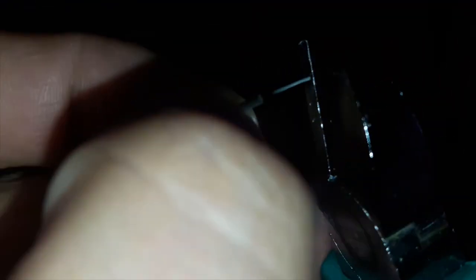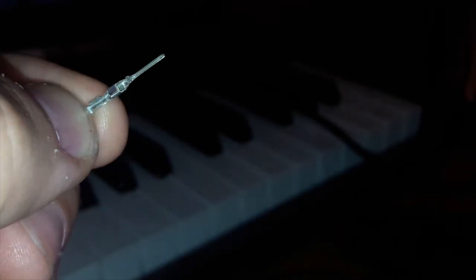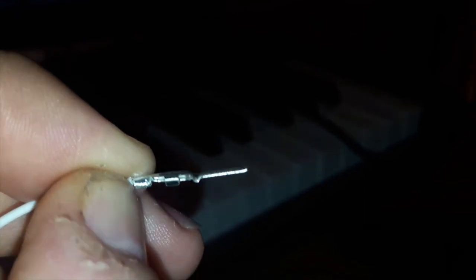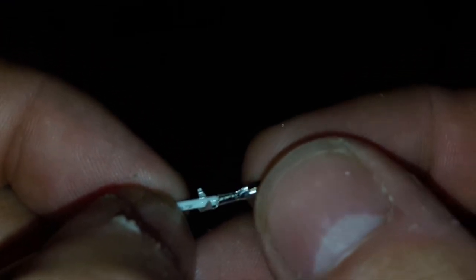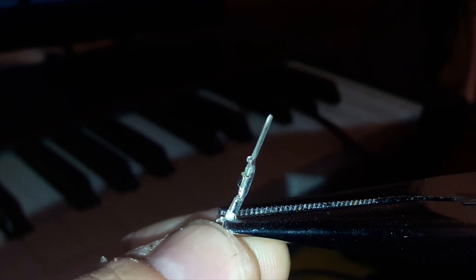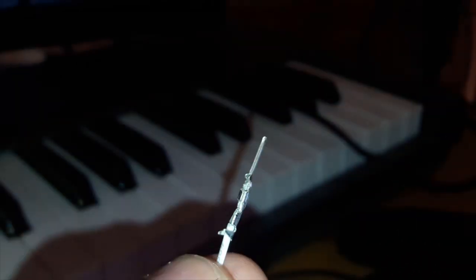You take a wire and strip off some of the insulation. Then get your wire cutter and cut the wire down to a few millimeters — just enough to occupy the small pair of wings. If this is a female connector, be extra careful that no wire is obstructing the tip. Place the wire inside the connector and hold it down with your thumb, then give it a firm squeeze so that the wings close around the bare part of the wire. This serves two purposes: first, it makes sure you can't push the insulated part too far in; secondly, it will stop the wire from falling out too easily. You then turn the connector around, hold it upright, and give the other pair of wings a gentle squeeze — again, this is for stability. Make sure you leave some room between the tips of the wings, because that's where the ridge of the M-shape will go.